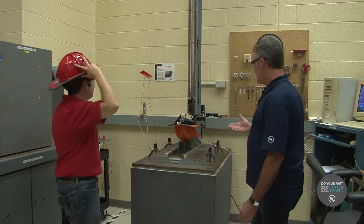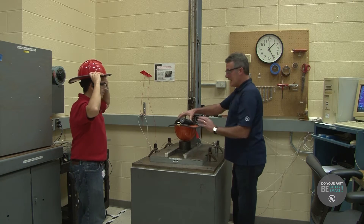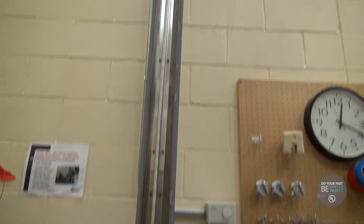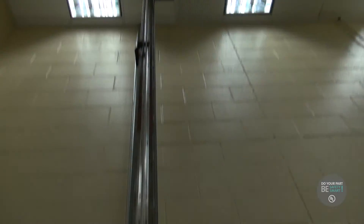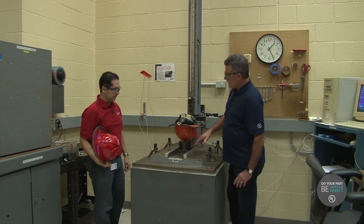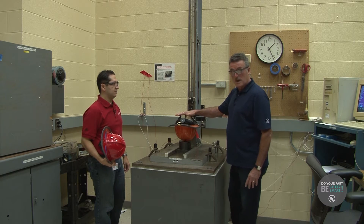It's just one very unique part of an ensemble for a fireman's protection. We're trying to protect them when they're doing their job, and this is a very key part for head protection. This is a pretty fun test. What we have here is a head form — we call it a cranium — and we've got this big tower. We know the weight of this thing and we measure the speed of how fast it's falling. When it impacts this anvil, we'll have an indication of how many G's, or how hard it hits — basically what kind of force we had on it.